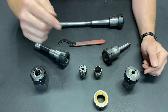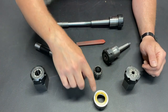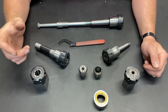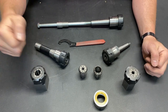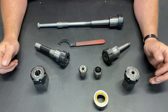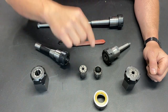The second benefit — and this is why this is such a huge improvement as far as I'm concerned — is that you can get this nut tighter than a standard nut, and that just increases your holding power. I've been running one of these for about six months. I wanted to put it through its paces before doing a review on YouTube. And every time I used this nut, I was able to get it a little bit tighter, which meant there was never any issue of slipping. It was also easier to loosen and tighten. When you're tightening it down, you don't have to really reef on it to get the same tightness. And when you go to loosen it, it's not that hard — where a standard nut can sometimes take a little bit to get loose. By going with the bearing style, you can really tighten it down and increase the holding power.